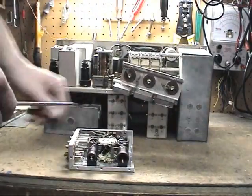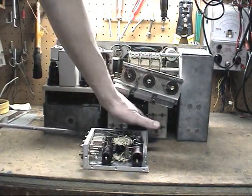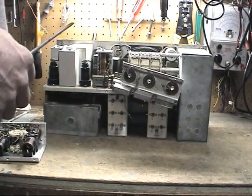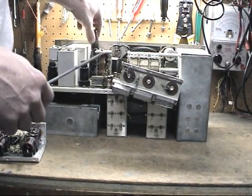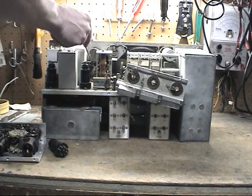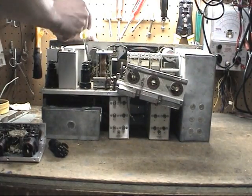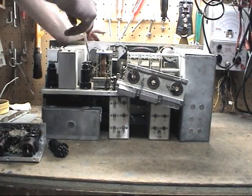What you want to do then is just reverse these steps, put the covers back on, put it back in, and then you can proceed to your other two. A couple other tips: obviously you want to go and replace all your capacitors. A couple of important ones — there's an audio capacitor back here. Take the 6F6 audio tube out and all the way back buried in here there's a .01. You definitely want to replace this one back here — another tough one to get to. It's just going to take a little dexterity to be able to get in here.